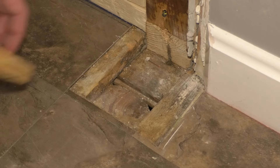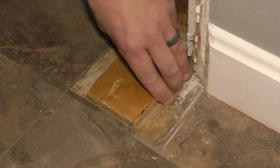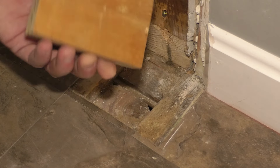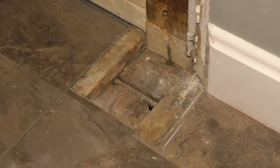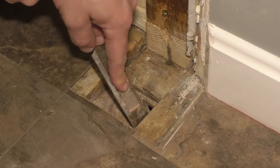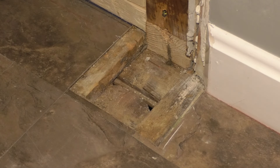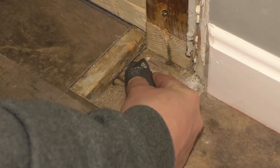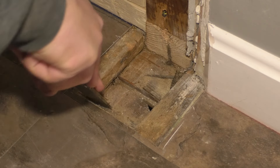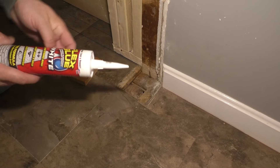I'm okay with having gaps here — you could fill them afterwards, or you could cut this at an angle and make it perfect. I'm just going to do two and five eighths by four and a half and I'll have some gaps. Let's see how this piece is going to fit. You always want to test fit it before you actually put it in there, so you don't want a bunch of glue there and then have to take it out and cut the piece afterwards. Now I want to clean this out. You can use an old chisel or whatever you have to scrape this, make sure all the years of dust and debris are out of there. I have some felt paper right here that I can cut with a knife. Now I'm going to vacuum that out.